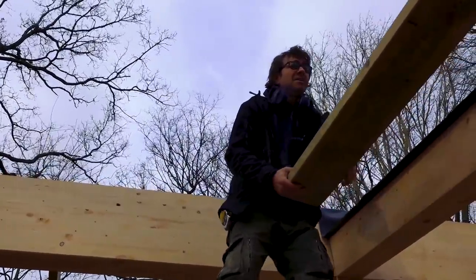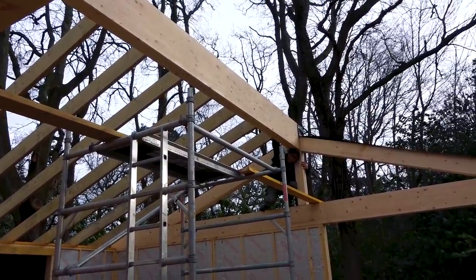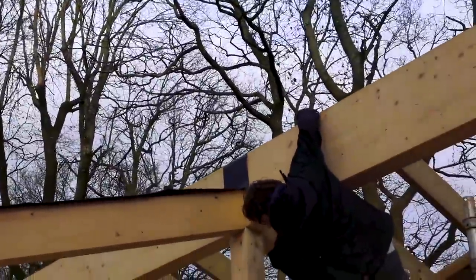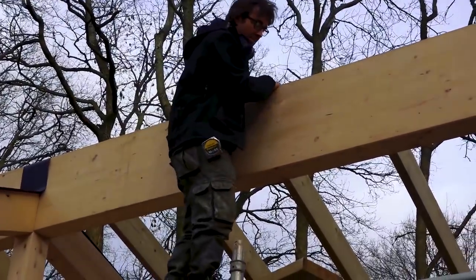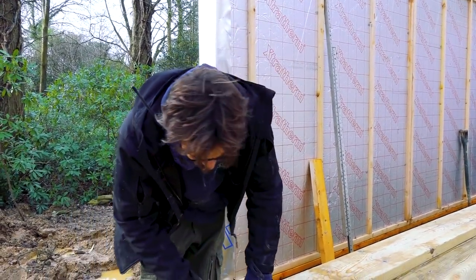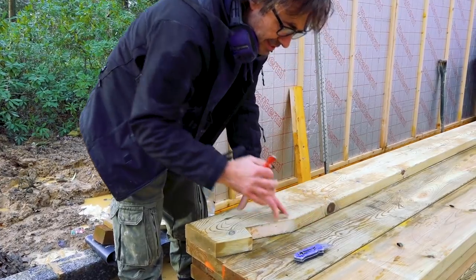You can see I've had to put a bit of damp proof course over the tops of all these beams because the water will run off. I'll just keep my eyes shut — it's a lot easier. Yeah, that's good to go. All right, we're happy with that, so now we can get that down and work everything to that. I was just taking the fur off the other side of the cut. That's the side I cut through with the circular saw, and that's the side I want to use the template off because that's exactly right.